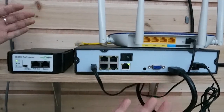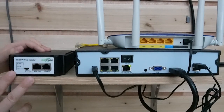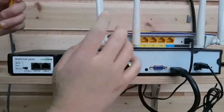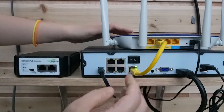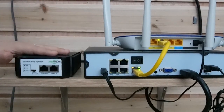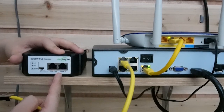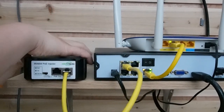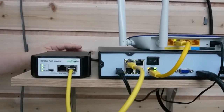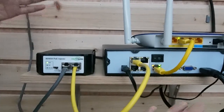So now let's do the connection together. Let's pretend this is our customer's control room. We have the router forming the network, the PoE NVR, and the 90W PoE injector. First, we need to connect the router with the PoE NVR — make sure you plug into the uplink port to get data. Then I'm going to connect the PoE NVR with the PoE injector. Make sure you plug into the right port; we have a data-in and a PoE-out port — connect to the data-in port. Then power it up. You can see the indicator lights are on. Make sure you plug in the PoE output port with the ethernet cable. This side is all set.